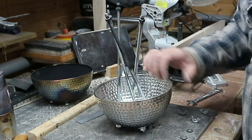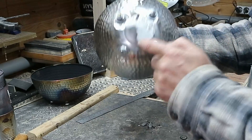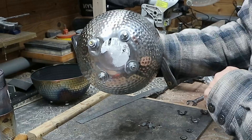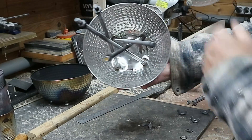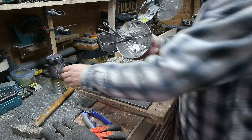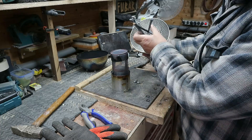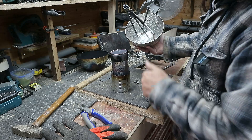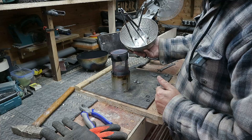So what we have so far: we've got these four threaded rods drilled through this steel bowl, we've got some washers on there and some nuts on there. On the inside I have some nuts as well to secure them in place so they're not going anywhere. Next step is we need to take the complete burner chamber and fit that in between these four rods. That's quite finicky, so I'll fast forward and we'll take it from there.